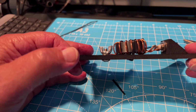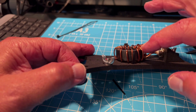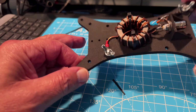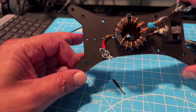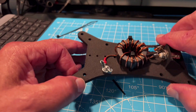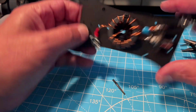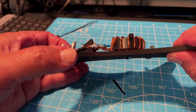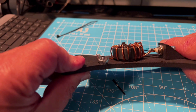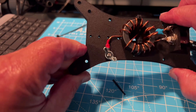Now when we put that heat shrink on, what's going to happen? Well, we're still going to see the protrusion of these wires. They're going to be highly defined. That's what happens when you put the shrink wrap on. But these have rounded edges, so they're going to be less likely to puncture through that heat shrink. So, before, squared edge sticking up. After, the squared edge is on the inside of the toroid.